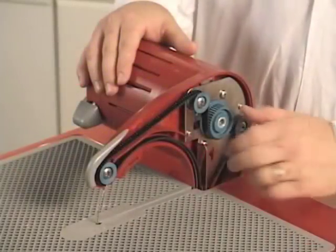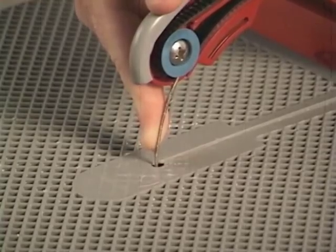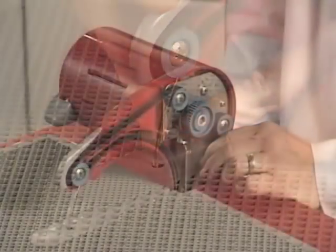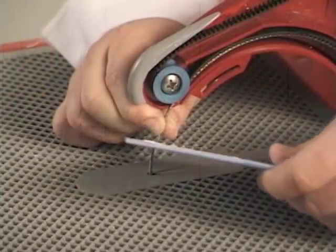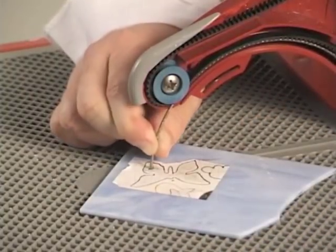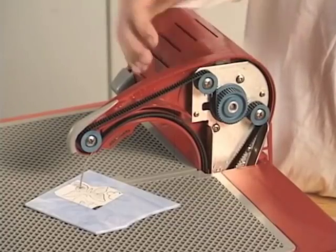In order to find the coupling, you must turn the drive gear counterclockwise. Place your finger on the blade to highlight the difference in color — the coupling will be slightly darker. Pull the belt off of this pulley. Now that you've taken the belt off of the pulley, you've released the tension and you're able to pull the blade apart. Slide the glass over the blade, find the hole, and put the blade back together. Now wrap the belt back around the pulley. Don't worry about any gaps in the coupling — when you reattach the belt it will close tightly.